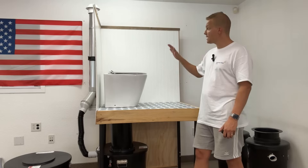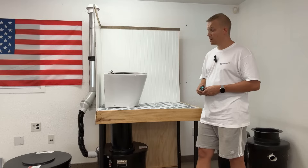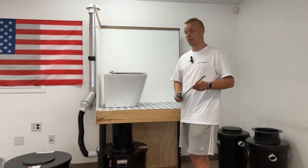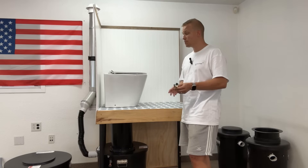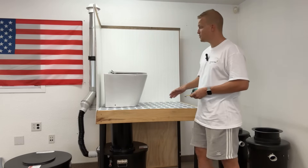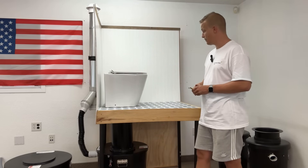In this display mock-up installation I had 32 inches of space below, but in reality the GL90 system only requires 18 inches of space below the bathroom floor level. There are two ways to install the system — have a look online at the different installation options. The basic principle is that you need the porcelain pedestal directly above the composting container under your bathroom floor level.